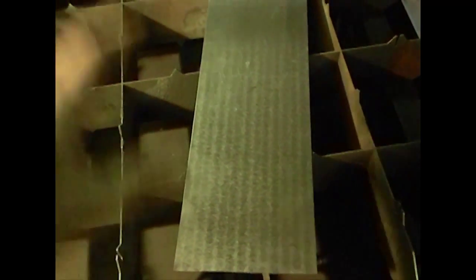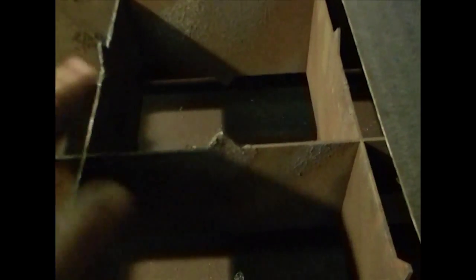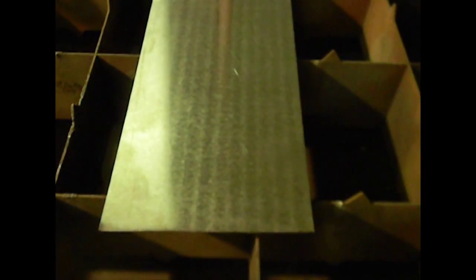With the Plasma Cam — now these machines are great, I use it all the time. If you want to put a piece of metal on this table and cut out a nice pattern, no problem. The pattern and the skeleton rest on these points — I hope you can see those. But what happens when you're trying to cut strips is, once you cut them, getting them to balance on those points is a huge pain in the neck, especially when you're working with smaller pieces of material. That's the problem I really needed to overcome.